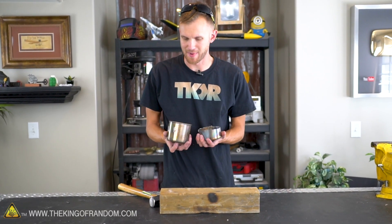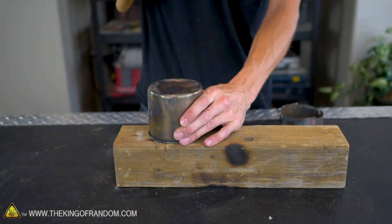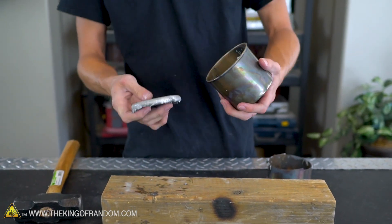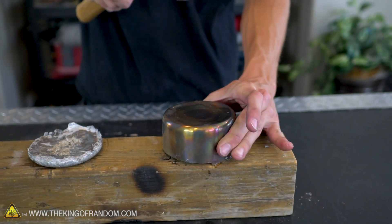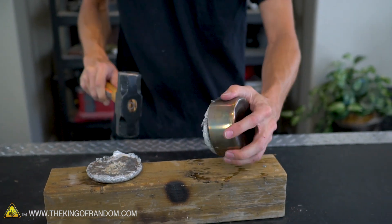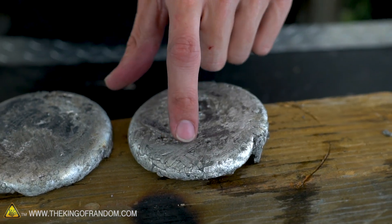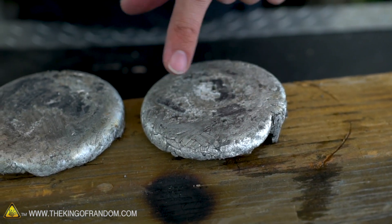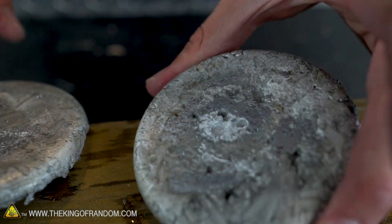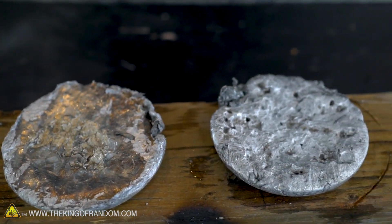I want to try and get both of these pieces of aluminum out and see what differences I can find, so let's see if we can separate them. This is interesting — these are pieces of aluminum that melted, but I never stirred the aluminum on top, so you can just see the stick formation left. This one seems to have more pitting and bubbling on the bottom, and again, this is the one that was in the vacuum chamber and this is the one that was not. I think I want to cut both of these in half and see if there's any difference on the inside.